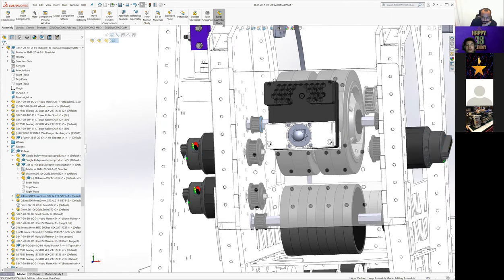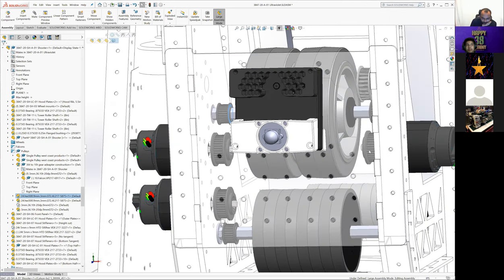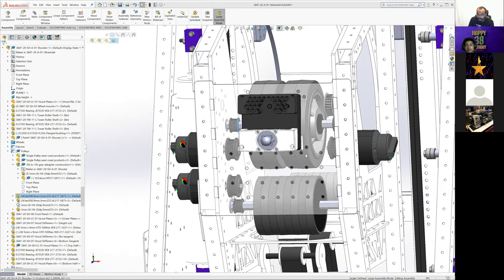So we're making the top speed of our shooter wheel potentially way faster, right? If we ran these motors full bore, these would be spinning up towards, what is that, like 9,000 RPM, right? If the Falcon's spinning at, what's the Falcon spinning at? 6,300, whatever it's spinning at? Something like that. So if we were running this full bore, these would be going at like 9,000 RPM.